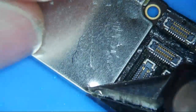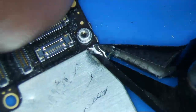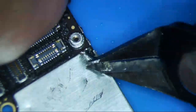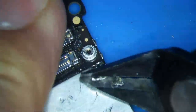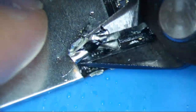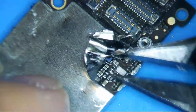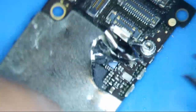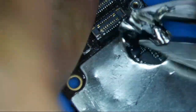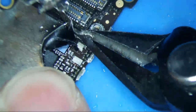Hopefully not break anything. It doesn't look like there's any chips in this corner — it looks like it's probably just capacitors, and capacitors are a lot easier than replacing chips. I just know that it takes a while to remove these stupid shields. It's not a five-minute job. Finding the fault will be a lot easier than removing these shields, especially when it turns out to be the last shield.